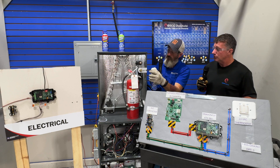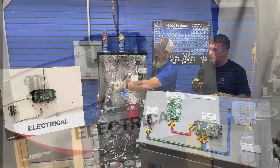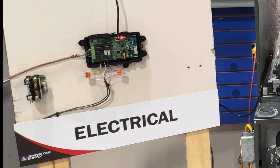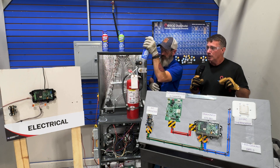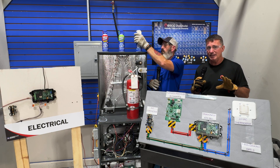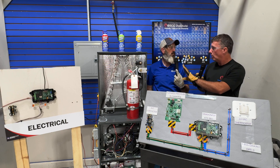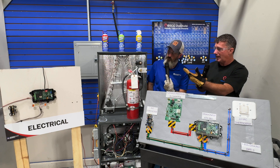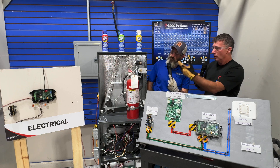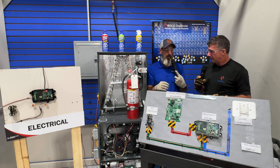So let's give it a try and see how fast this responds. We're going to introduce some R1234yf in vapor form into the cavity. Already our RDS sensor has detected the refrigerant — you can see the flashes, so it's going into mitigation mode. Within 30 seconds it should shut off the outdoor unit, shut off the gas furnace if it was running, and turn on the blower. We've dissipated the gases — it already stopped detecting refrigerant and now we're in that five-minute lockout.